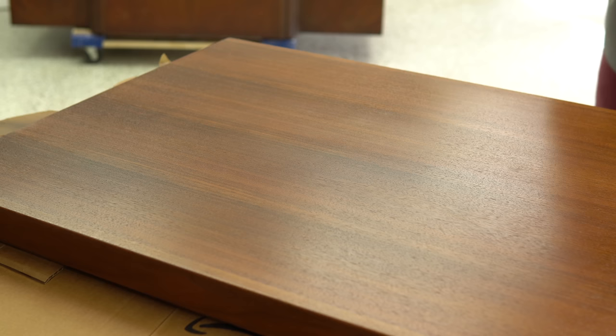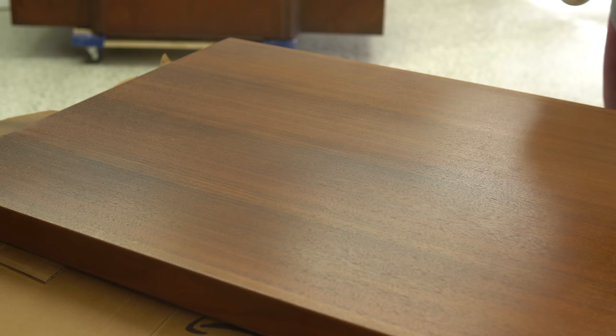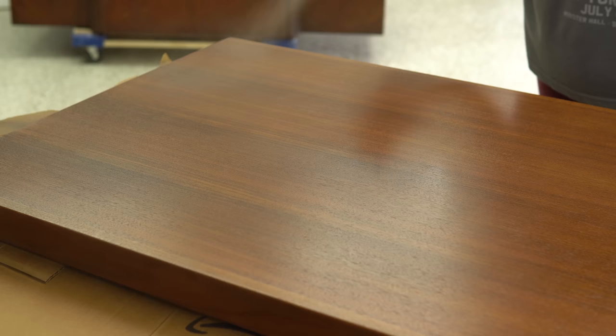Basically, what I'm saying is I'm not super close to the table, I'm just sort of fogging the color on. Toner is very easy to get blotchy if you're too close to the piece. So I like to do several very thin coats from a good distance. You get a much more even consistency.